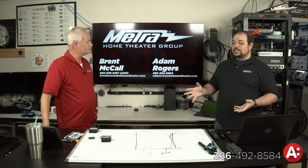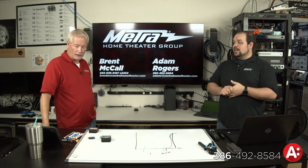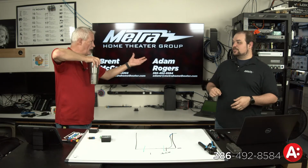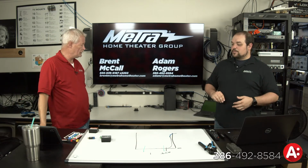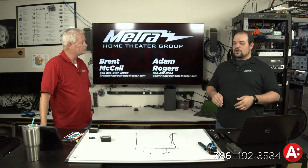Really great thing about that is it is just a normal IR extender block and kit. Connecting block. Which allows you, of course, to receive an IR signal on a device somewhere else. Do the included IR receiver. Yep. And then extend that over to multiple IR outputs. With four emitters included. It has a total of 6 outputs with 4 of them included.